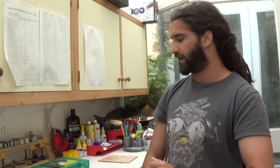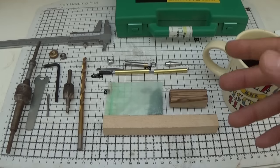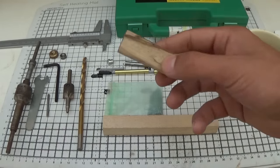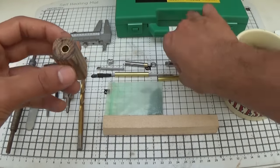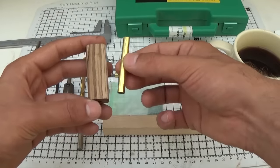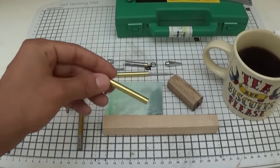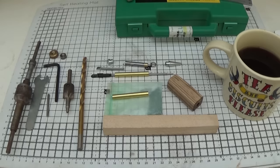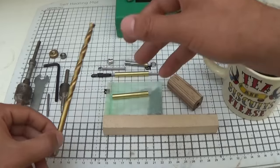So we've got love, luck, generosity, balance, promise, and protection from negative elements — pretty advanced stuff. I'll probably do this video in two parts, so stay tuned. The first thing I need to do is drink some coffee and get my wood blanks prepared. This is one I've done earlier — I've trimmed the wooden blank down and inserted one of these brass tubes from the pen kit. I trimmed the blanks to about 55 mm, drilled out the center on the lathe, and inserted the brass tube using the 7 mm drill bit from my pen turning mandrel.